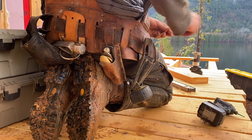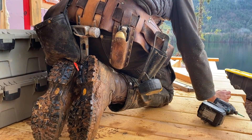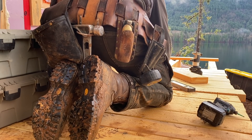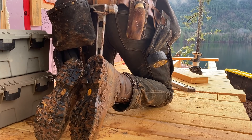I'm just using a screw for spacing here. These boards are really green so they're gonna shrink a bunch more — they'll probably end up being a solid quarter inch gap, which is what I want.